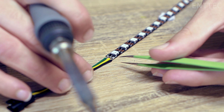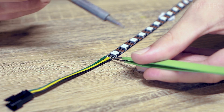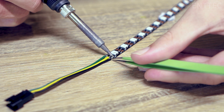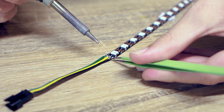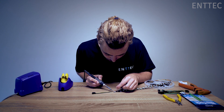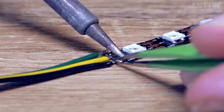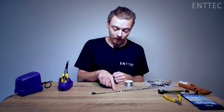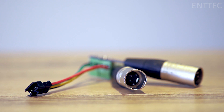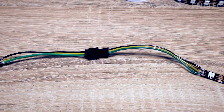Now it's time to solder our connectors to our LED tape. This step is delicate because the terminals are small. You'll also need to retain a bit of downward pressure on the wire so that it doesn't spring away before the solder joint cools. If you particularly value your fingers you might want to use a pair of tweezers. And there we have it — we've now soldered our connector to our pixel tape. We can now use a matching connector to wire into a controller, or we can even join another section of tape allowing us to chain sections together with the detachable link.